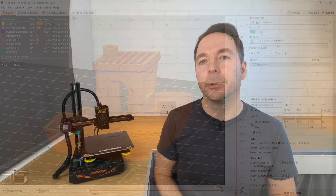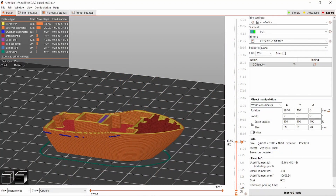Once that hotend becomes trustworthy this could be an awesome base for a true desktop 3D printer. If you already have a larger 3D printer and want something smaller and more portable without giving up quality then you might love this model. That's pretty much the position I'm in and I can't wait to modify this little machine into an absolute beast. However as it is I don't think it's quite there for a complete beginner, which is probably who Kingroon are aiming this at. There can be a very steep learning curve when you're getting into 3D printing and the last thing you need is random hotend clogs tripping you up. Hopefully Kingroon have taken note of the feedback I gave them detailing the issue with the hotend and there'll be a solution on future models. Yes the Prusa profile seems to have prevented any further clogs but I still don't trust it fully after so many problems.